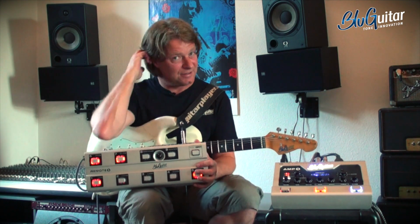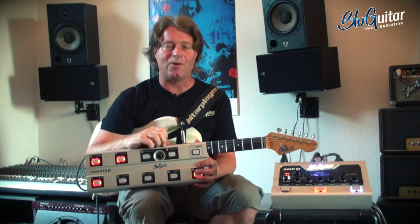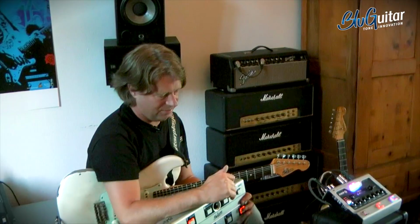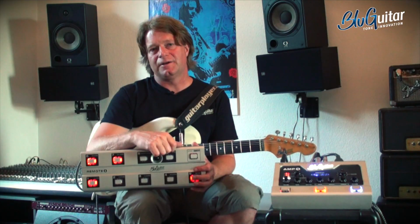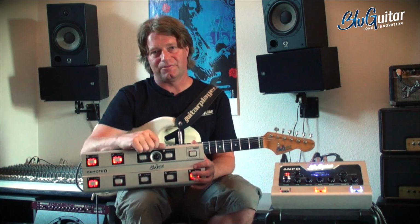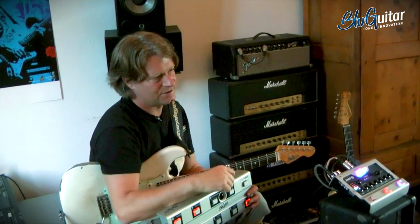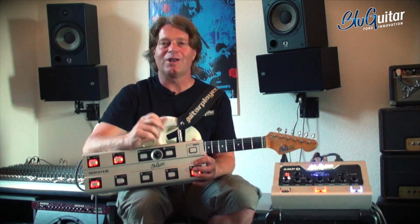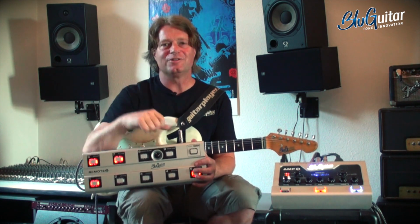Back in the 80s, last century, people invented the so-called power soak, and this was a resistor array which was deducting the power from the power amp stage. So you had your 100-watt amp or 50-watt amp, whatever, and you brought in some resistors and changed the output power into heat. So some of the heat was dispersed, and the remaining power was getting to the speaker. The result was you had a lower volume, so you could survive in another surrounding. In the 60s, you were allowed to have 100 watts on stage and fill the room from the stage, but this is a problem today.